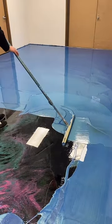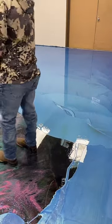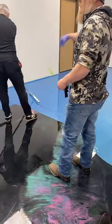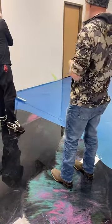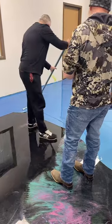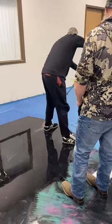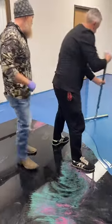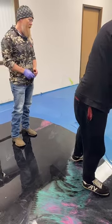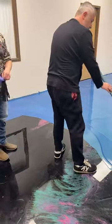Just do this. Don't come down the floor. Keep it out there. Just go across like this and get a feel for it. Before you pull the squeegee towards you, just feel for it and just smooth that floor out there, out in it though. And just get a feel for that. And you can tip the head sideways so you're not leaning. Yeah. There you are. Now feel that. You see how smooth that's getting? You just caught a whole bunch of thick epoxy there.